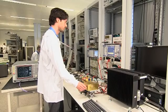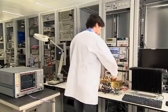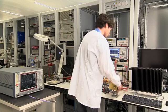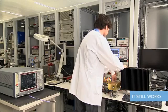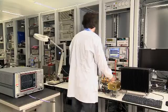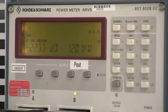The extreme conditions vary from VSWR 55 to 1 to 125 to 1. Now we show the transistor is still alive by going back to the original load and showing the 1200 watt output power — and it still works. Would you ever dare treat a transistor worse than this? Well, check out the next test.